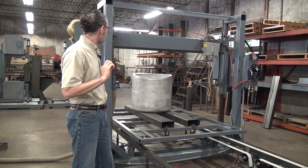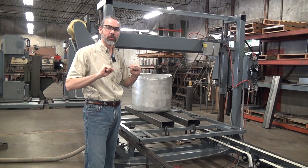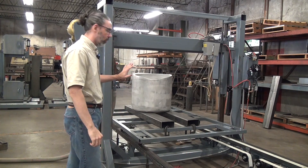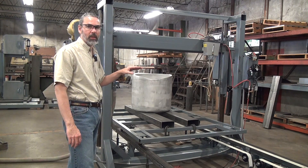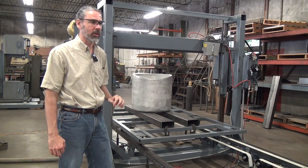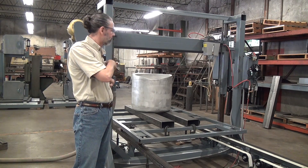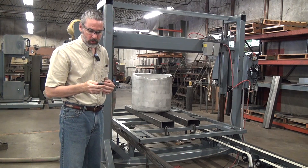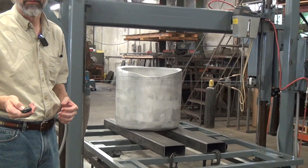On a typical metal cutting saw you run the blade much slower and with a lot more force — those machines are designed to push the blade into the workpiece much more aggressively. This horizontal configuration, with the blade cutting in a horizontal plane, doesn't really allow for that. So we're going to be easing the workpiece in and making a lot of fine small chips, instead of peeling off big long chips like you might see in a more typical bandsawing application. I'm going to zoom in on the cut, turn on the coolant system, and then we'll start.